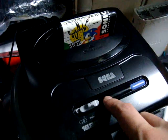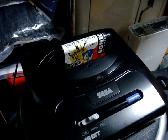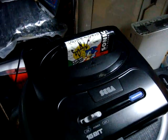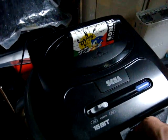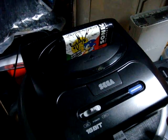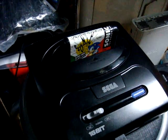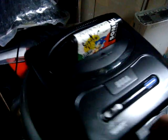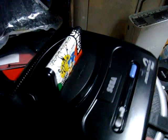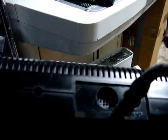On some of these older machines, I made this little cheap device and it does find out the connections — where you're getting your video and audio from. It's not by any means the most professional, but hopefully it'll help out those who don't have the money to afford one of the specialty connection testing devices. If you have an old game machine — this happens to be a Mega Drive 2 — if you look on the back, you'll notice a honeycomb-style connection that says AV out. It kind of looks like an S-video connection, and from it you can get your video, your sound, and sometimes S-video.